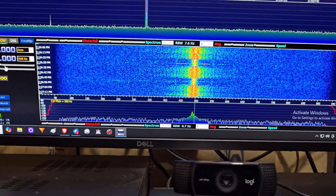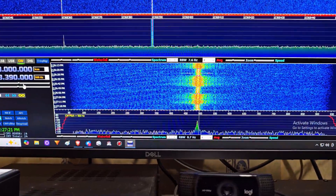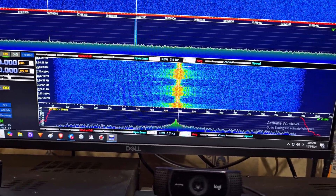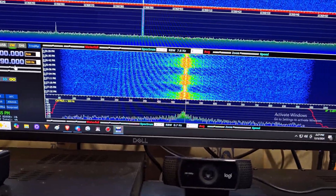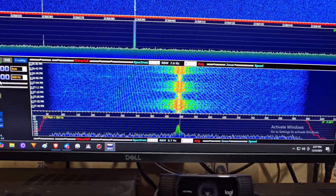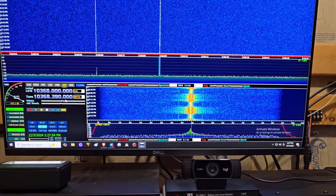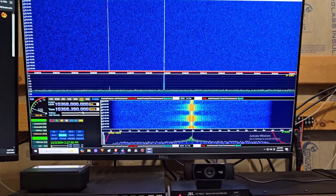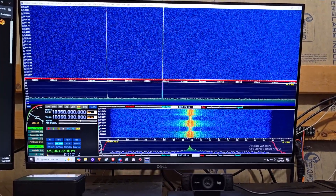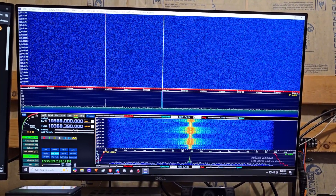If you have discerning eyes and ears, you may notice the carrier looks like it's zigzagging back and forth a little bit — that's not the beacon. Something has happened with my LNB-based SDR receiver here in the shack: it's got this cyclic frequency movement of about 8 to 10 Hz now; it was just 1 or 2 Hz when I first started. So something is going funny with my receiving system — that's the receiver, not the beacon doing that. Yet another project to look into one of these days. But anyway, there's your introduction to Quick Beacon, which will be going on the air up on the hill at the beacon site slash repeater site as soon as I can get the antenna mounted and a radome on it. Soon we'll do another video talking about the better beacon I was building and what's happening with that. Thanks for watching — hope you enjoyed it, see you back next time!